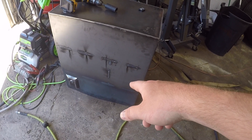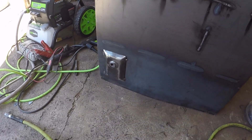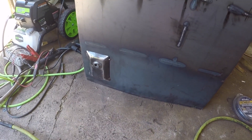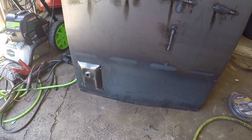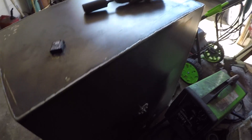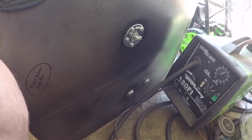It's got two baffles in it and I put a sump on it — it's a very small sump, looked bigger in my head when I was making it. I still have to put the other end on. I'm not great with thin sheet metal — I like welding really hot, so things warped a bit. It's not going to be perfect but hopefully it'll hold fuel. Once I get the other side on I've got to pressure test it, make sure it holds air. We got our new sending unit in, a return fuel port, and a spare port. I'll probably end up using a vented fuel cap.